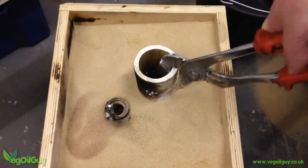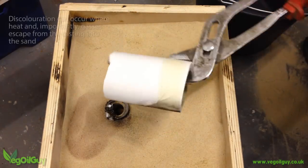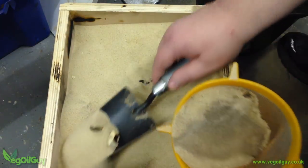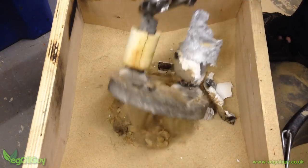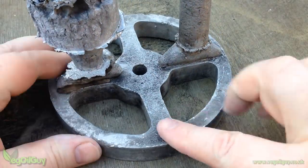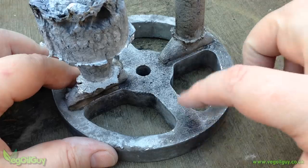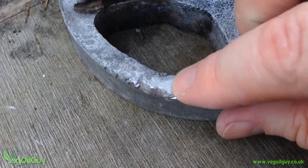Roughly an hour later, I decided to dig everything out. Other than where the metal had laid on the surface, there was no sign of sand discolouration — and we want to see sand discolouration. So I excavated slowly, trying to take the dry sand away in thin layers, but there was never really any sign of discolouration other than towards the very bottom. When removing the work, I was actually quite surprised — I expected much worse. With the plaster and sand quickly removed, it doesn't look too bad. I'm feeling the edges here and there's a fair bit of roughness — it's hard to see but it's easy to feel. There's a tiny amount of distortion, plus swollen and blistered surfaces.